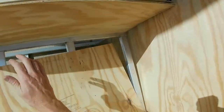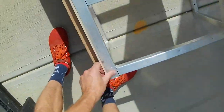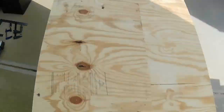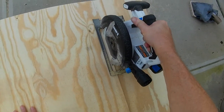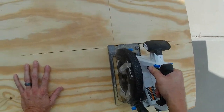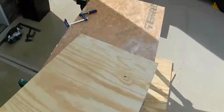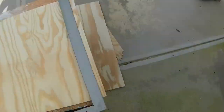We're just going to check the fit and make sure everything lines up the way I wanted. Then we go back and put it on another sheet of plywood to make the second bench bottom — basically just marking it off and creating a second one. I'm free-handing these cuts without a guide because this is a bottom piece so it doesn't have to be absolutely perfect, but I've got a pretty steady hand. We test fit it — it was a little bit long, so we knock off about a half inch and we're good.